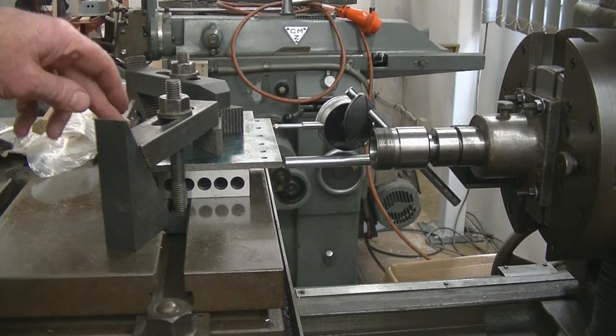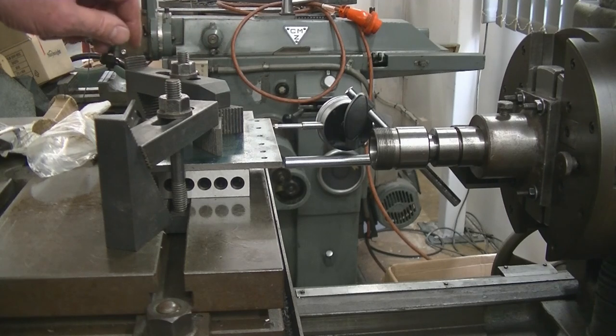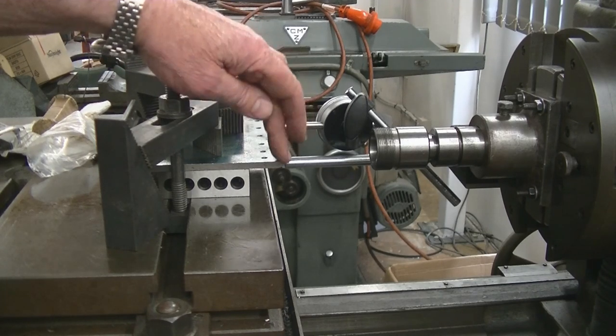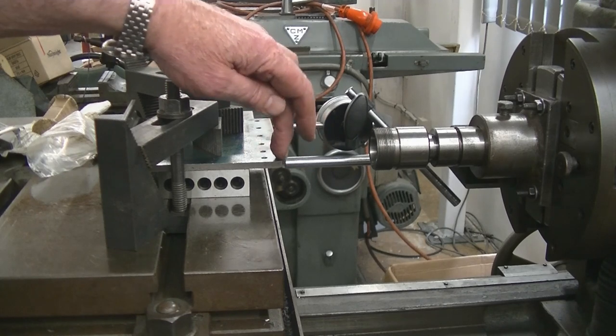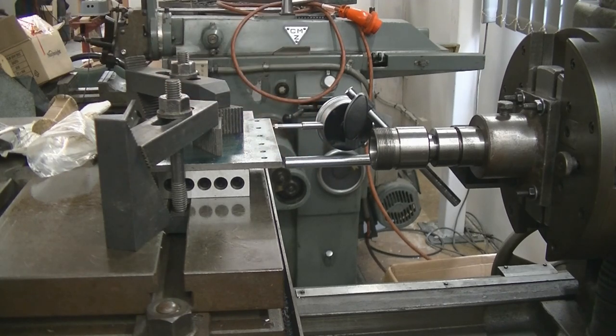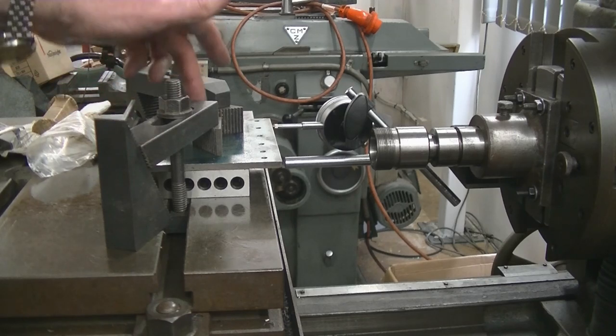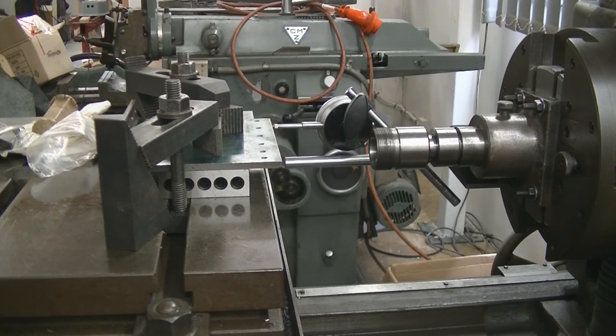I've taken one of the brackets off the mid-frame spacer, or the motion gear spacer, and I found that there's about 0.4 to 0.5 millimeter too wide here, so it's actually spreading the frames a little bit as it goes in. And although that's not a big error, these brackets are just a bit off, bloody dead on. The middle of the plate is dipped by about half a millimeter, and it's all bloody additive. So I'm trying to get rid of each little defect as I can.